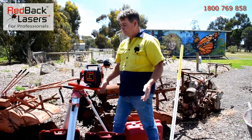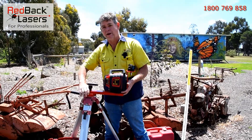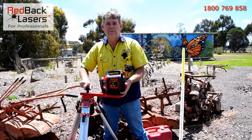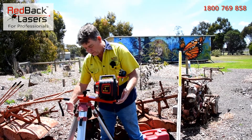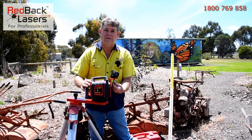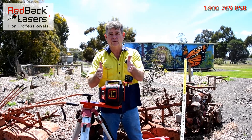We've set that up on the tripod. As you can see, with the laser offset bracket tightened onto the tripod, we now have the ability to adjust the laser and get it positioned exactly where we want it. We don't have to muck around trying to get our laser right without knowing where it is. We'll be aligning off a plumb bob or directly underneath the scope, working as an offset from the scope to the laser at all times.